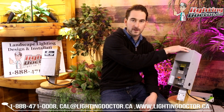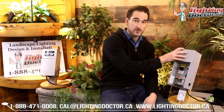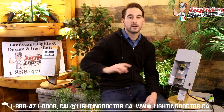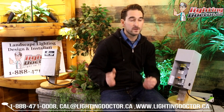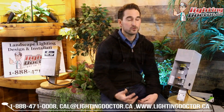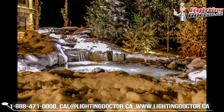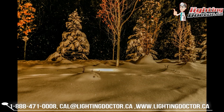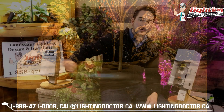Here's a trick: say you have a system with 40 lights and you're worried the transformer isn't big enough — but some of them are path lights that only use two watts, so you can easily fit all 40 lights on this transformer. But you're worried about voltage drop because you have to run some of those lights a long way out — say along two sides of a driveway. What you can do is put one line out of the transformer going one way, and another line going to the other set of lights. So you'd have 20 lights on one run and 20 on the other.